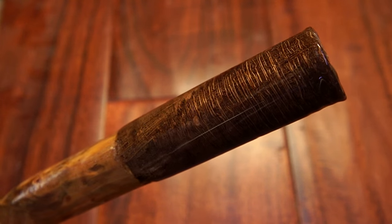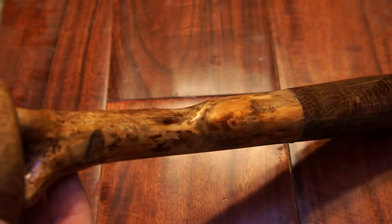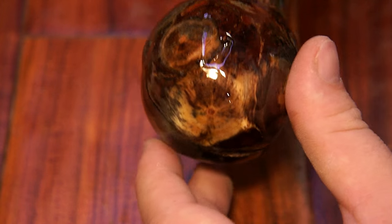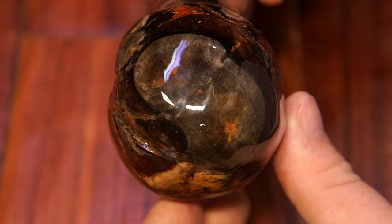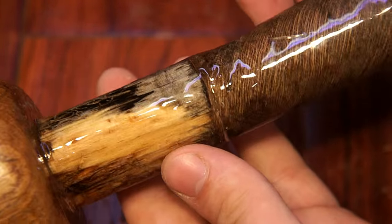Here we have the finished product. The handle is really hard to capture in video — you can't quite see how deep the texture is and how far in you can see. On part of it I did go back and use the wipe-on poly, which made a nicer transition into the heads. The heads on both mallets I finished with wipe-on poly because I didn't want the epoxy taking any impacts. You can really see all the little spalting in the bottom piece — the bacteria or fungus that changes the color — and up toward the top you can see where all those little worms were boring under the bark when it was sitting out in the woodpile.